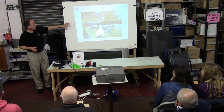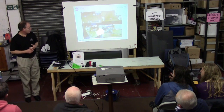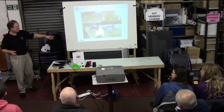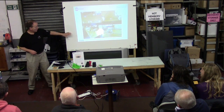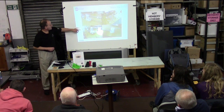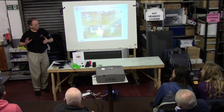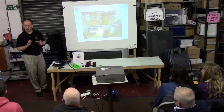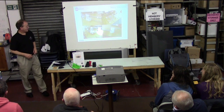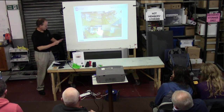You start putting it together, you build a frame. It doesn't take a long time — we did this over several evenings. We tried not to let it encroach into the day, because we had real jobs to do, and slowly the frame builds up. You start putting your Meccano together. There are nice little bits where pieces push onto the metal bars — they're a push fit — then you screw a couple of bolts and nuts in each side to hold them tight, and they won't pop off again. That's very flexible; you don't have to thread everything onto the bars, you can push them on from the side.